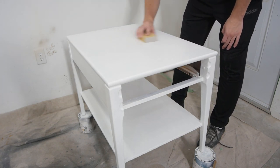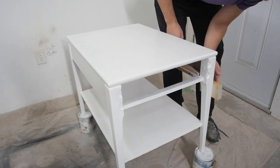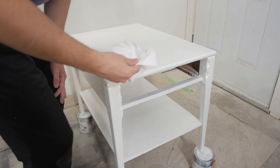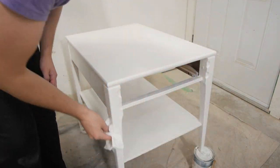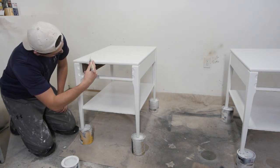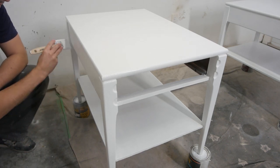After the first coat of white paint dried, I'm using the 220 grit sanding sponge again to get rid of any uneven surfaces and smooth things out for the next coat. Don't forget to clean up any dust from sanding and make sure it's super clean before applying the next coat. I apply four coats of white paint total, which got me the coverage I was looking for — kind of. I'll show you what I mean in a minute.